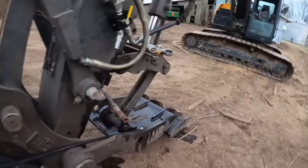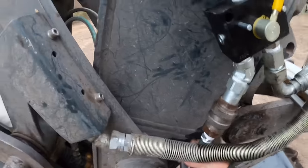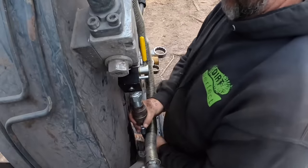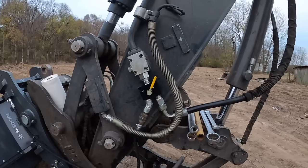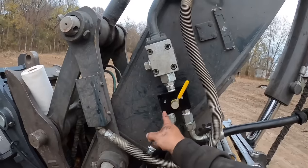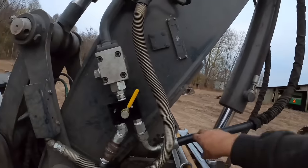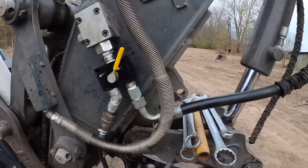All right. All I do is one-handed. We'll get her connected there. Oh, it's gonna go. Perfect. All right, so the way this should work, with that lever in that position, the hydraulic oil is gonna come through here, blocked off to this side, it'll come through here, flow through here. Thumb should work normal. It's all hardwired in, because we're hard piped in, because we're not planning on redoing it.